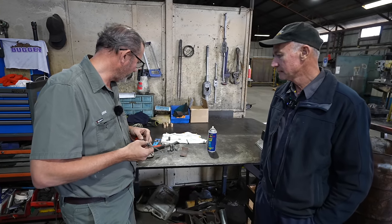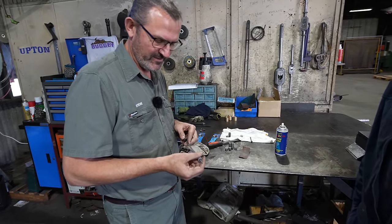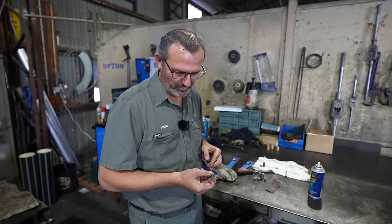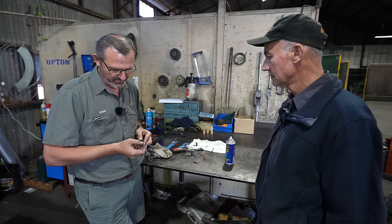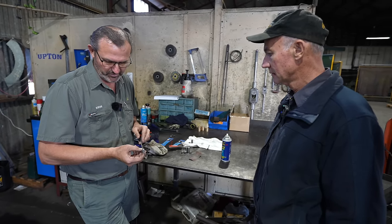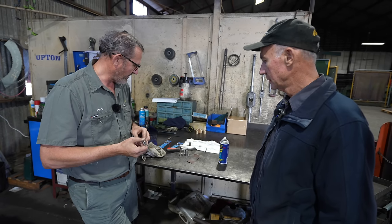They've all been machined by drilling, but the drill is slightly smaller than what's needed for the pin. So in order to get the pin size correct, we've got to file the inside of these out, which is the most economical way for us to do it. We don't have a fixed reamer that's the right size. So the main part is you've got to try and keep a constant pressure on the file, making sure that you're keeping that barrel nice and straight so it doesn't hourglass inside there, so to speak. And making sure that it fits.